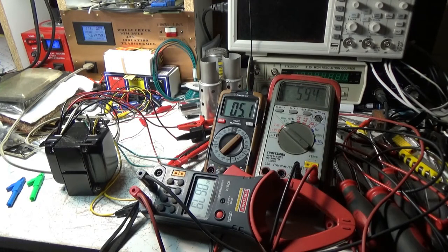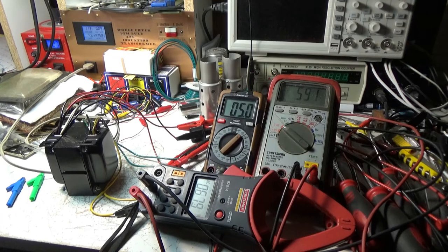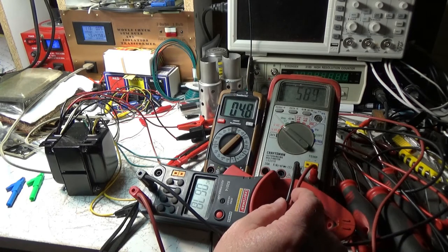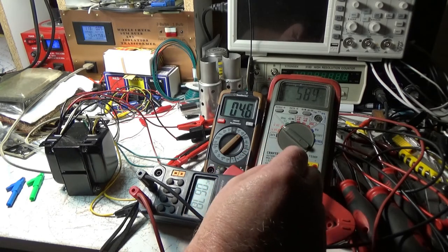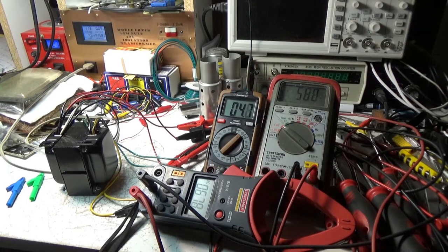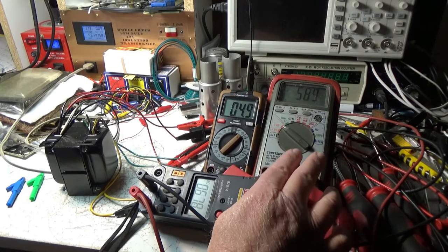Yeah. I've had this meter for a very long time. Trying to think when I bought that, it was probably 96. Yeah, 96. And I used it at work for many years. The reason why I went to the Fluke is because when you go between continuity and voltage, which I had to do at work a lot, troubleshooting electrical wiring on man lifts, cranes, boom trucks, that sort of thing, heavy equipment, I would forget to move this to the continuity. So I would be checking voltage, then I wanted to do a continuity check, and I'd forget to do this, then I would be chasing my tail because it's not on continuity, even though the meter is. The Fluke, you don't have to change your leads when you go between continuity and voltage. And that's why I got this.